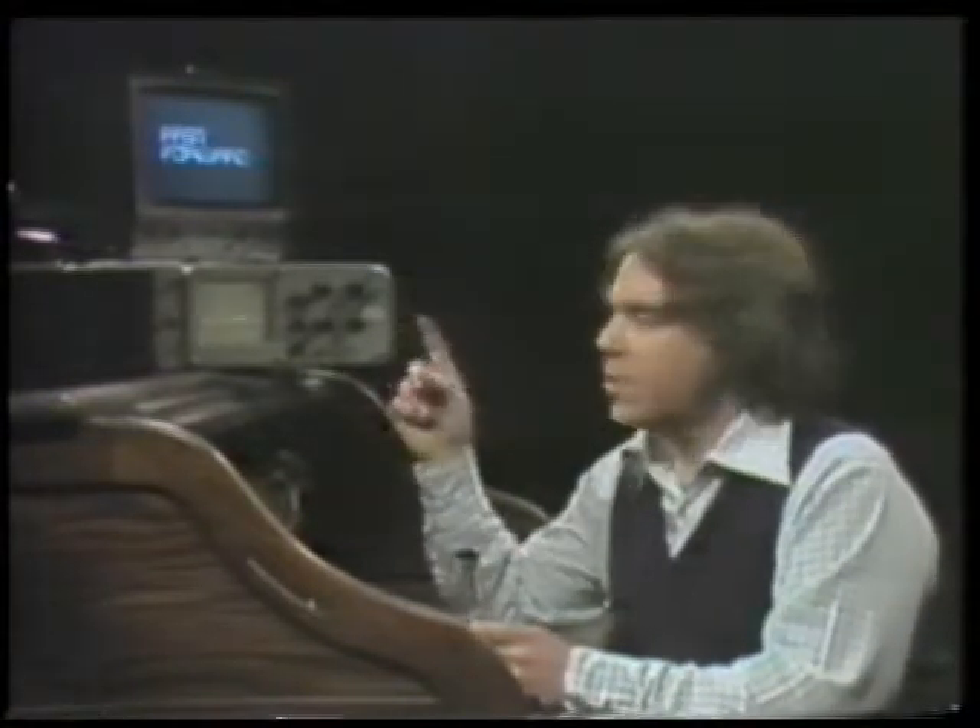Around the studio, that all comes from a little boring-looking box called a sync generator that runs all of the scanning in the cameras at the studio. And also, during those blanked-out periods at the right side of the screen and at the bottom, it transmits a thing called a sync pulse that allows your receiver to synchronize its scanning with what the studio is transmitting. And if you think that's amazing, you ought to see how color TV works.